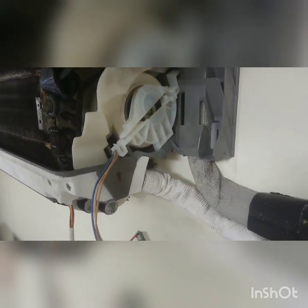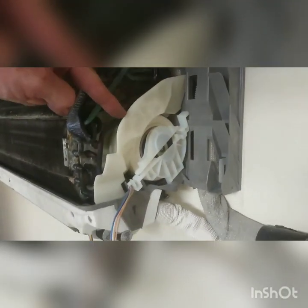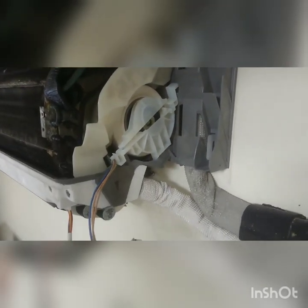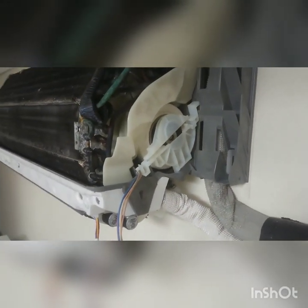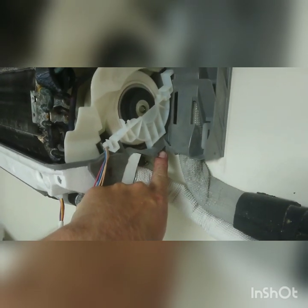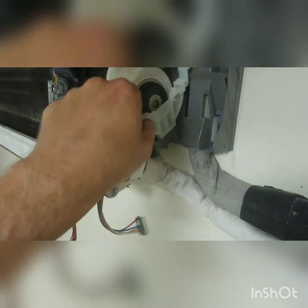There's a plastic bracket, and when it's in place it looks like this. The fascia gets in the way of the two screws, but it does have a bit of flex in it so you can push it out of the way and get your screwdriver in there to get the two screws out. Once you've done that you can remove this, and there's a small clip at the bottom which by pushing it in allows you to move this bracket.